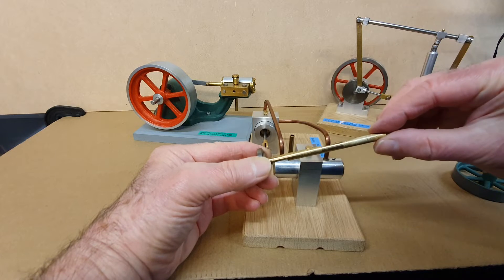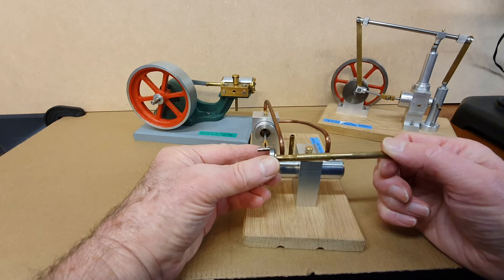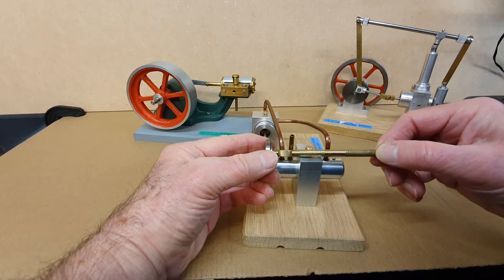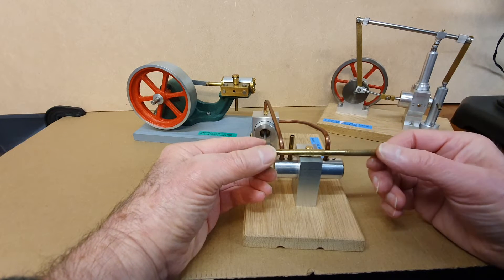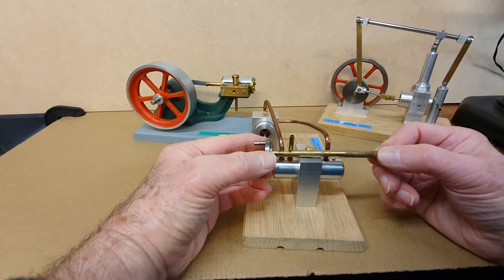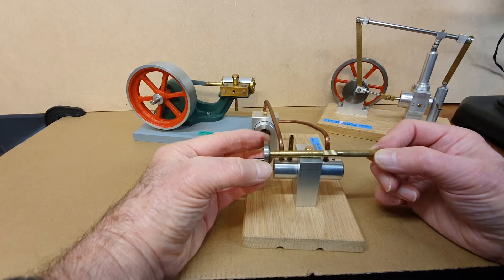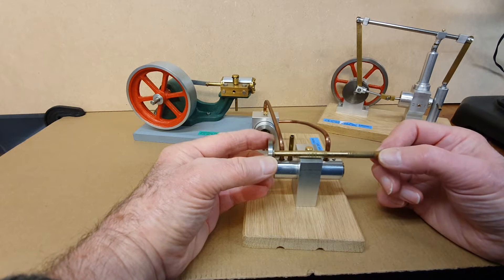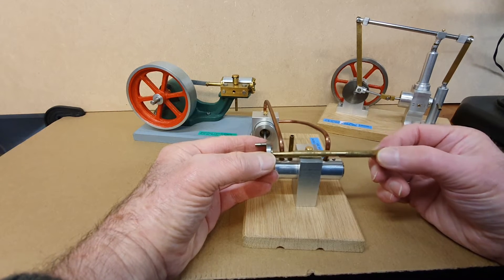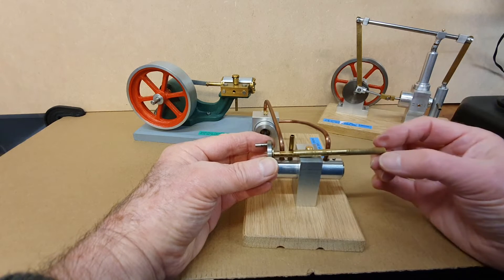This is controlled by parts machined out of opposite sides of the shaft — of the valve itself. As this rotates you can see it's controlling the air path here, and revolving around will control the exhaust path as well. It's a very clever design. It took me a while watching videos of this type of engine to understand how it actually worked, but the path of compressed air or steam is all very logical.